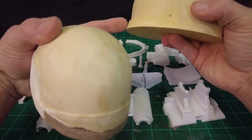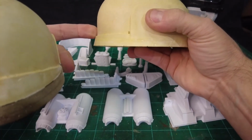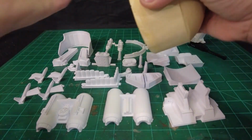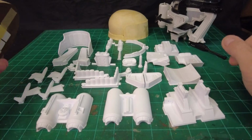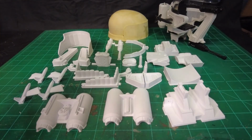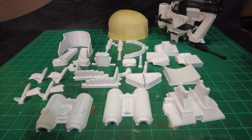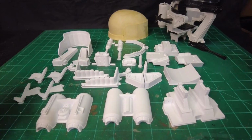has better contours at the base here and here, a little more draft angle, which makes the finished vacuum formed canopy easier to remove from the mold buck after the molding process is complete. Made it a little bit taller. It's a little more user-friendly, it's a little smoother, and it's oriented, I think, a little more conveniently. It makes producing the thing a little bit easier. The 3D model file for the revised canopy mold buck design will also be uploaded to Thingiverse.